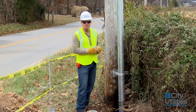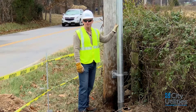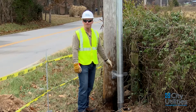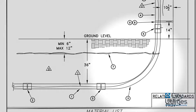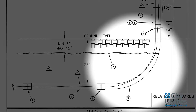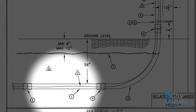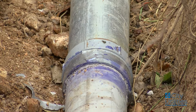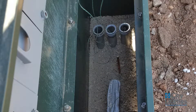Now that that's clarified, let's talk a little bit about the components you're seeing here behind me. This right here is a steel 10-foot stick, a four inch galvanized. What we have attached to the pole is what we call a standoff bracket — we have one at the top and one at the bottom. At the bottom, we have it attached to a four inch, 36-inch galvanized sweep. On the end of that galvanized sweep, we have a coupling, and on the end of that we have a five foot stick of galvanized pipe. On the end of that pipe, we have a four inch PVC — what they call an FA fitting or female adapter. That is how you transition from galvanized to PVC, going back to either a junction cabinet or possibly a transformer location.